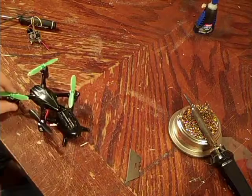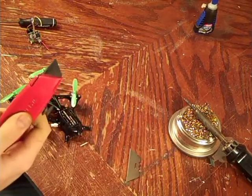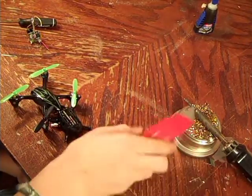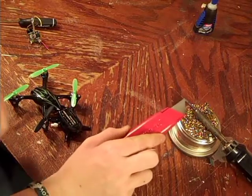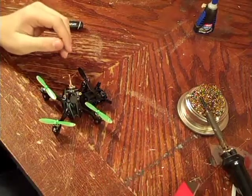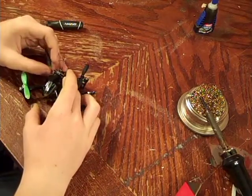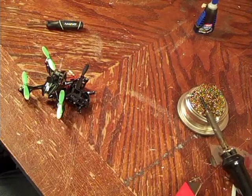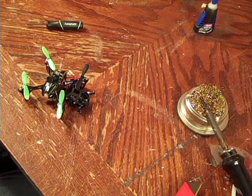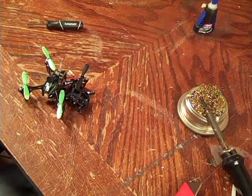Now that you have two well-seen lines, you can either use a lighter to heat up the razor blade or use your soldering iron — just put the razor blade on there and let it heat up. Now that you have your hole cut with the heated razor blade, you can slowly use this to angle your camera how you want it, and then use super glue, hot glue, or just about anything to secure it. I think I'm going to use some hot glue, so I'll plug in the hot glue gun and glue that on.